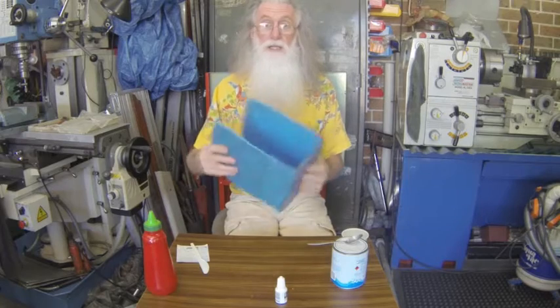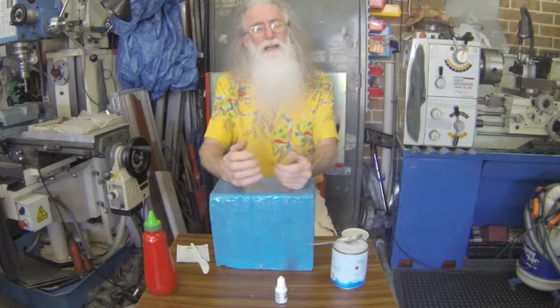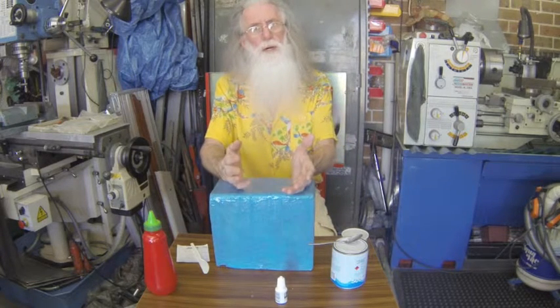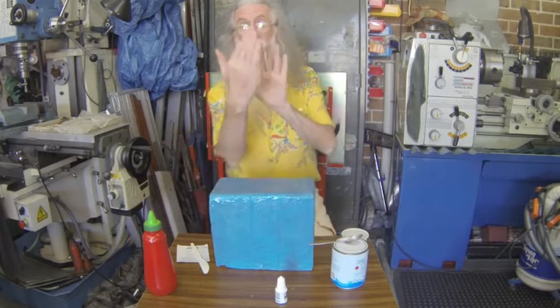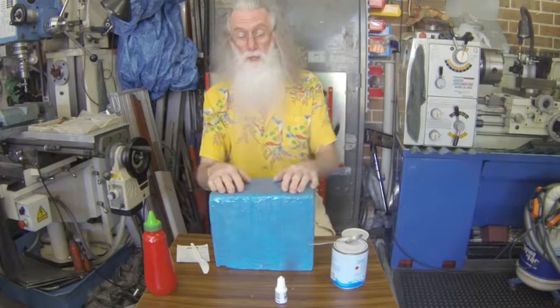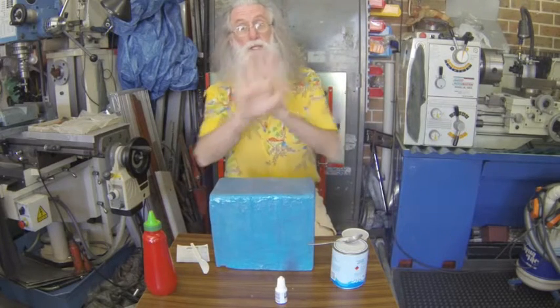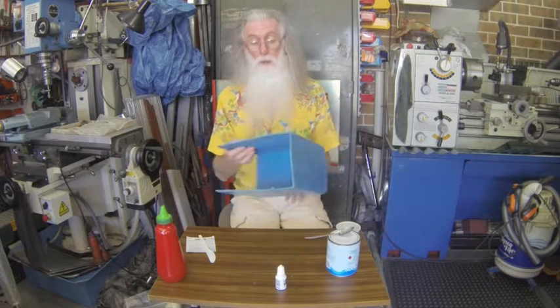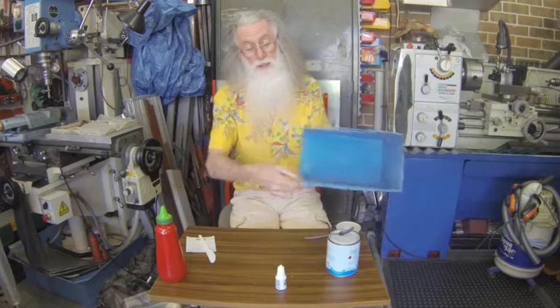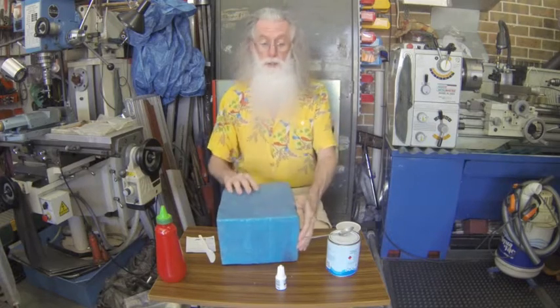cut the sheets up, lay them in dry, although they're semi-sticky when they come out, so they will dry even if you don't add water to them. So I would cut that up, feed them in, and even if they had dried, I would let them sit there dry. Then I would mix up the Flowcoat, push it in with a brush so it all stayed in there. And then perhaps I would get an airbag and put that on the inside, a couple of boards, and blow it out. Because the trouble with the G-clamps is they can fit on the edges, but they can't fit on the inside. And I had heavy weights sitting down pushing.